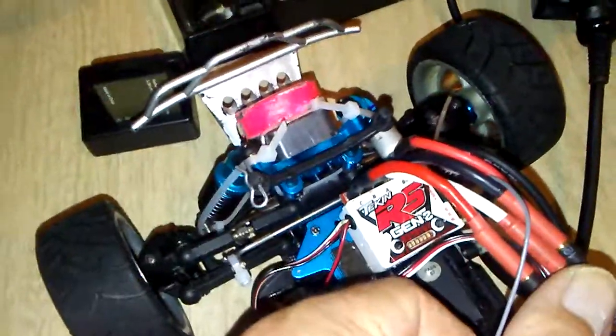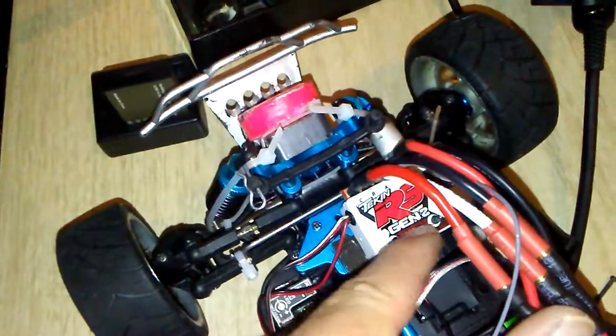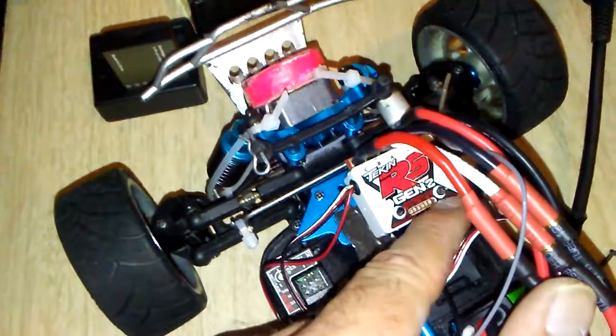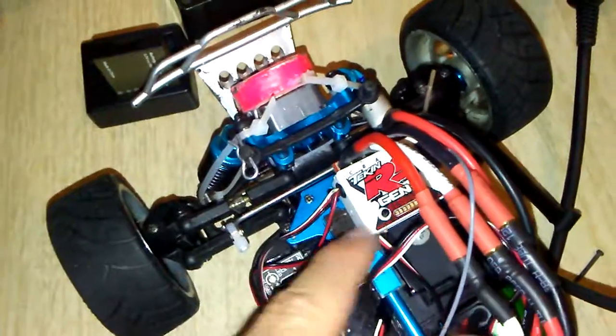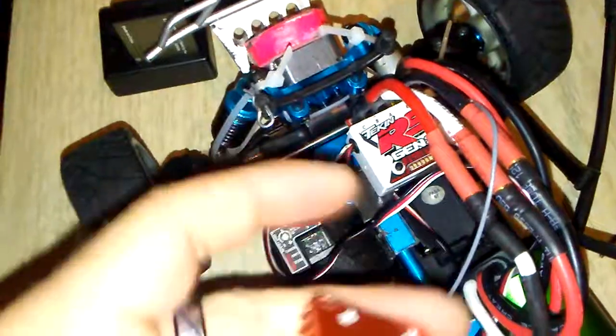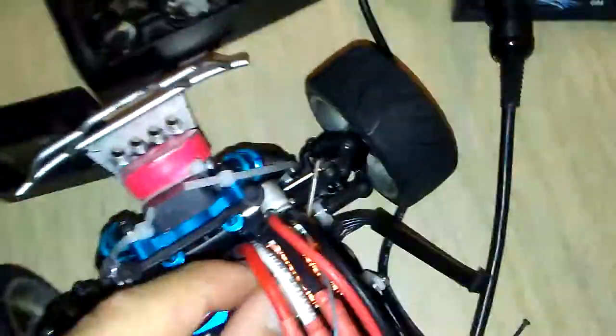But the other obstacle I had was these two buttons. You can actually do some mild tuning without buying their Hotwire interface, but these buttons stick up. So I did some measurements, and I drilled out 2 holes in this heatsink. So now when I put this on here, it goes all the way down, fits perfectly flush, everything's flat, and now my heatsink should work right.